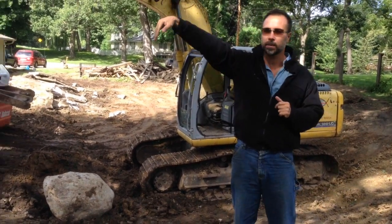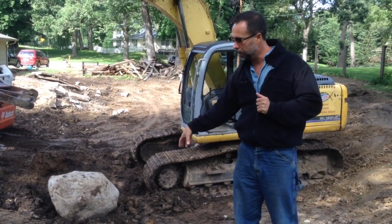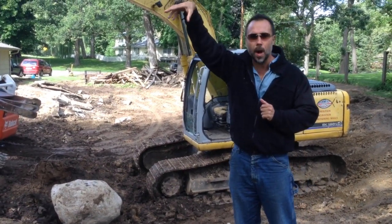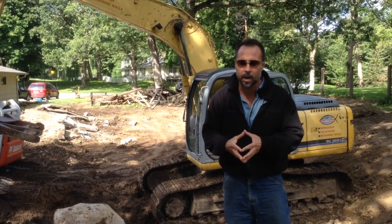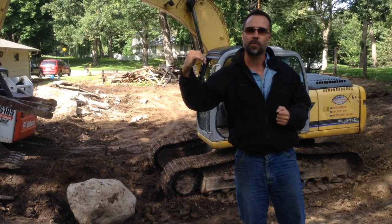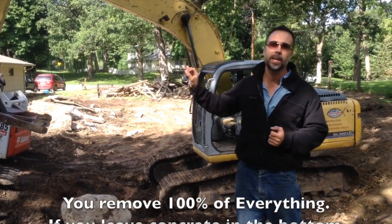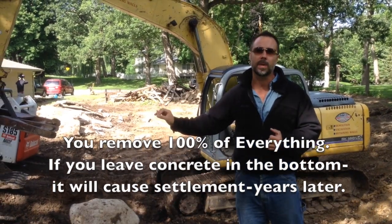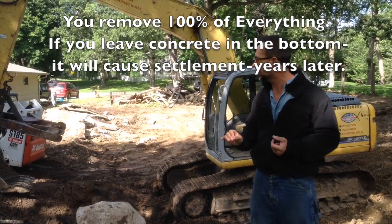You go into the center of the freestanding concrete wall, you fold it down. You pick the boulder up, you drop it on that folded wall, and it instantly spider webs that and releases the concrete from the rebar. Then you rake that concrete out, you switch sides, and you fold down the other side, and you drop the boulder. We're talking about being able to demo a concrete swimming pool in a third or even a fourth of the time if you were using a jackhammer.